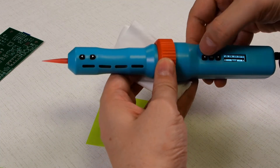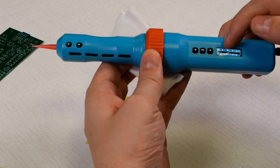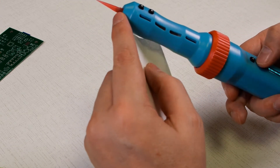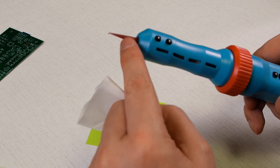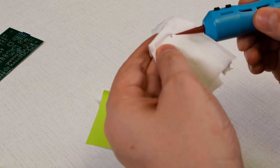After mounting the syringe with solder paste into iExtruder, navigate to the left direction icon on the OLED display with the help of the main unit's left or right buttons, then press OK. The lead screw will start moving forward, pushing the piston and filling the dispensing needle with solder paste. Because of the inner pressure inside the syringe, solder paste will continue oozing from the needle's end.